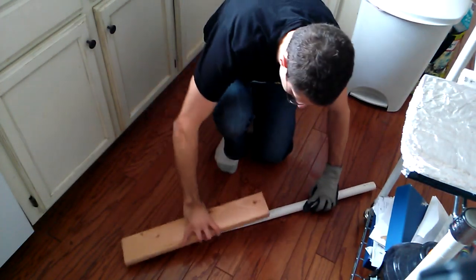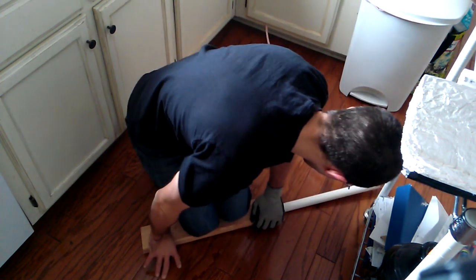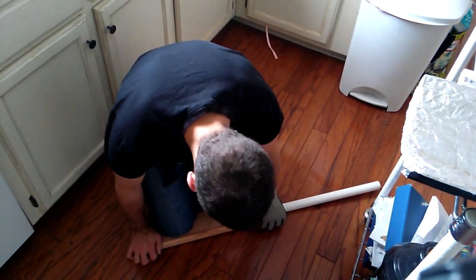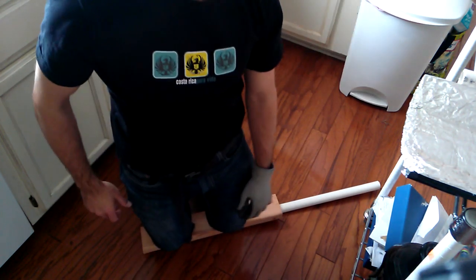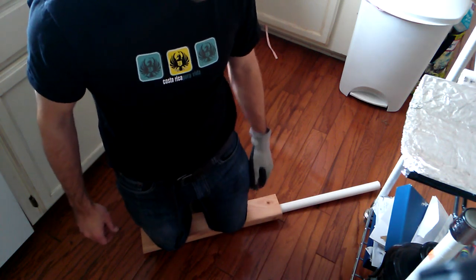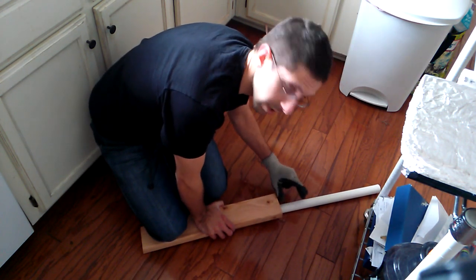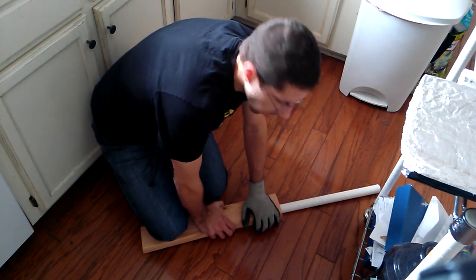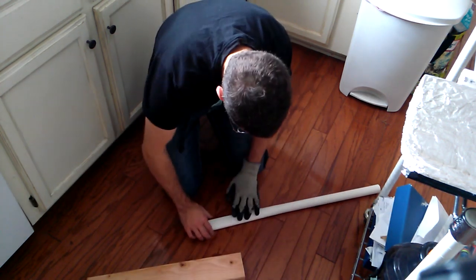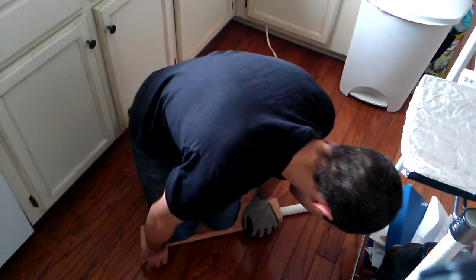With this piece heated, I'm going to go ahead and use the 2x4 and flatten it out a little bit more aggressively than I usually do. Because again, this is a really short bow — the core is very short. The final bow will not be short, but we don't want to overstress it too much. Nevertheless, some care should be taken not to over-flatten it near the handle. Over-flattening at that point could easily create a risk of limb collapse.